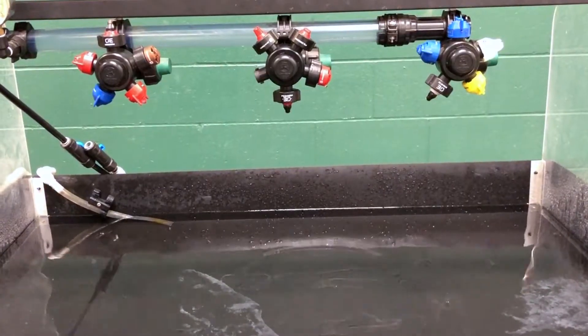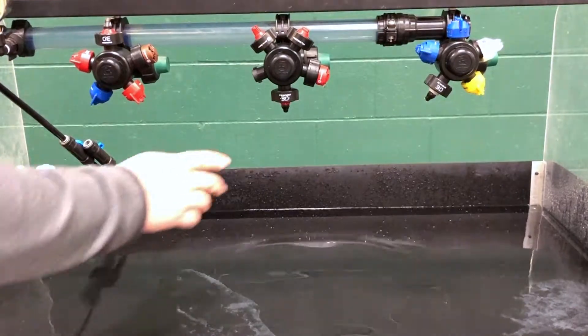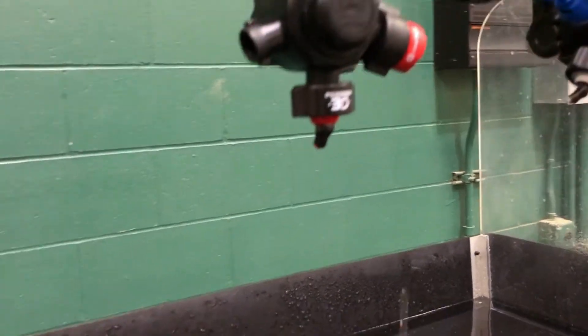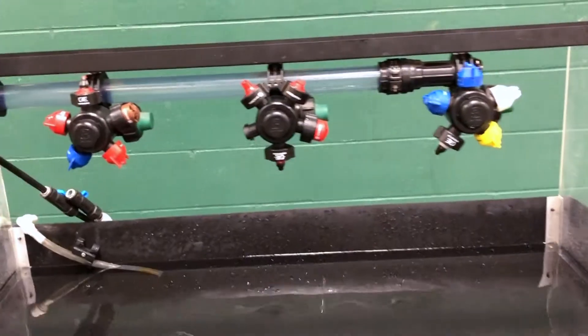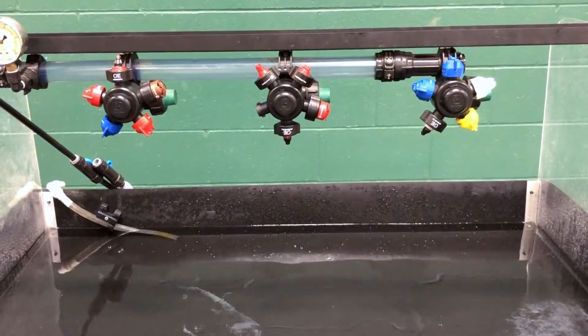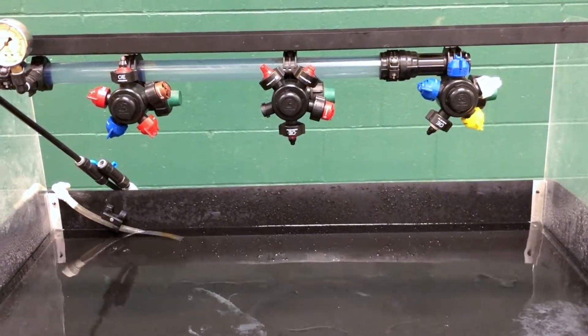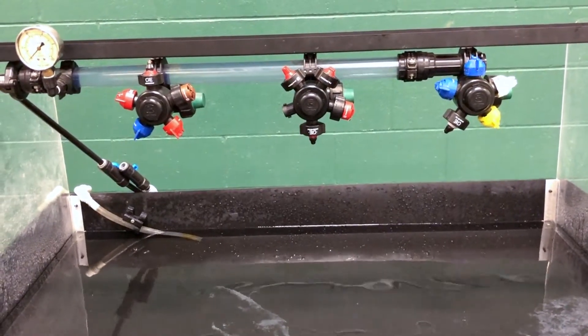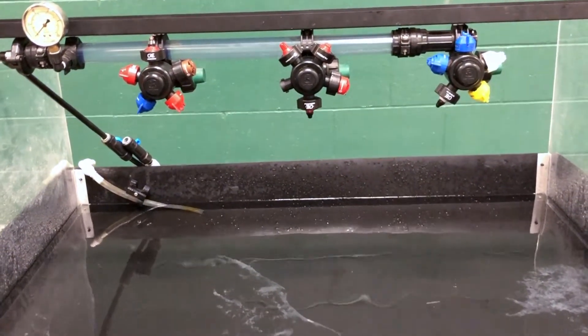This first tip is a tip that we use for Liberty. If you look from the side, it's got an angle to it. The idea of having the angle is, when you put them across your boom on your sprayer, you can angle one backwards and one forward and paint both sides of the plant as you pass over it. So I'll turn this on and we'll see the angle spray.